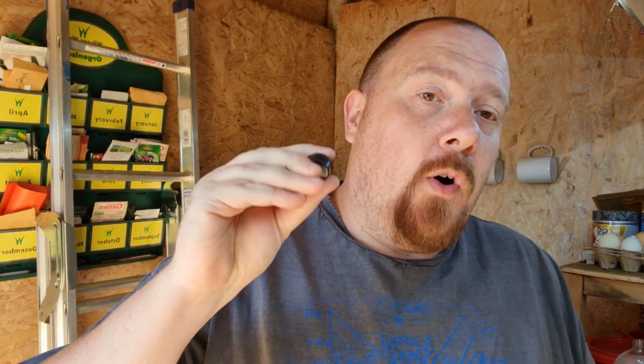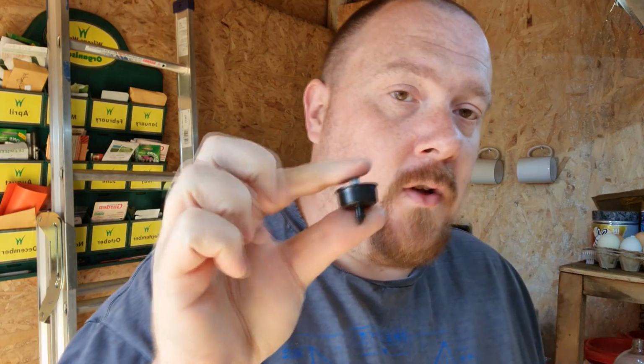Now, I can't remember all the numbers, and I'm not smart enough to write them down. But the way I did it is I did one pump, 10.6 litres per minute. I timed that by 60, obviously giving me the litres per hour. It's somewhere in the region of 636, something like that. These do 4 litres per hour. So I then divided the total of the pump litres per hour by 4, which in theory then tells you how many of these one pump can run, which I think, once again, in my instance, gives me over 100. Don't need 100, but it gives me over 100.